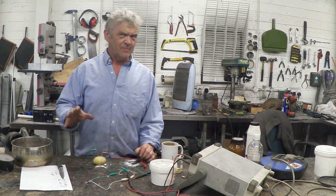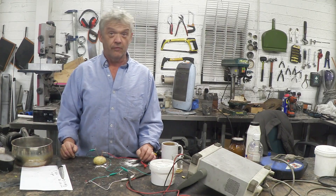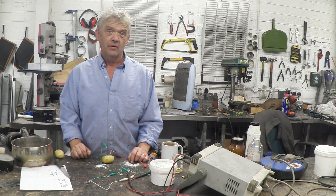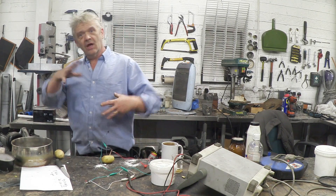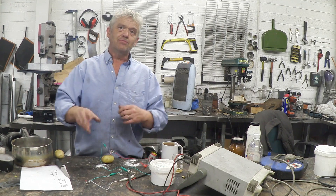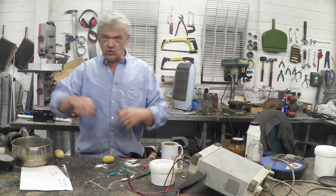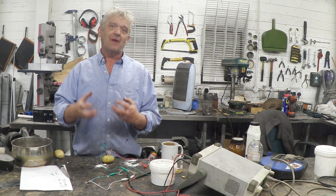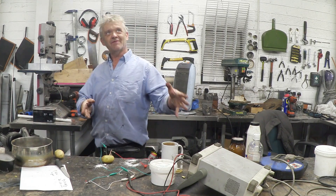The voltage is going to be roughly the same. In the raw potato it's 1.449 volts, and in the boiled potato it's 1.57 volts — so there's a slightly better voltage but a much better power draw. The boiling breaks down the cell walls in the potato, reduces the resistance of the salt bridge, so the voltage goes up a little because it's not dropping through that resistance. We're talking about the difference between half a microamp and 12 microamps — that is 24 times more power.